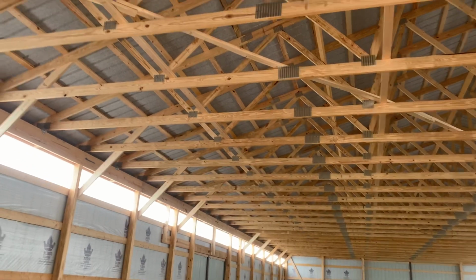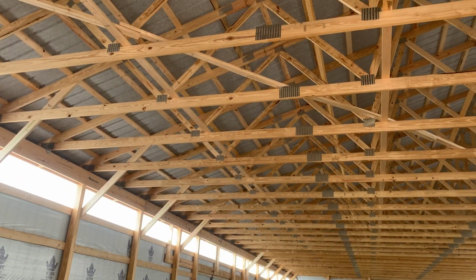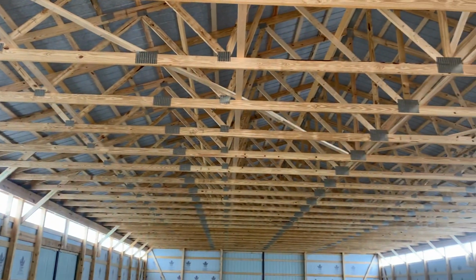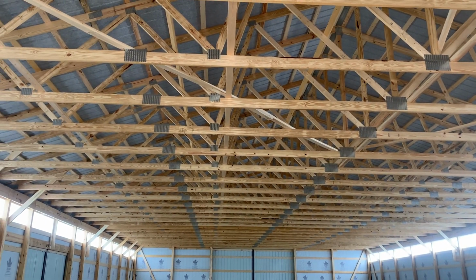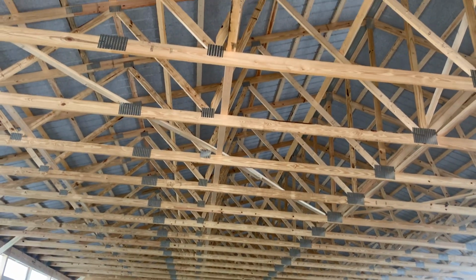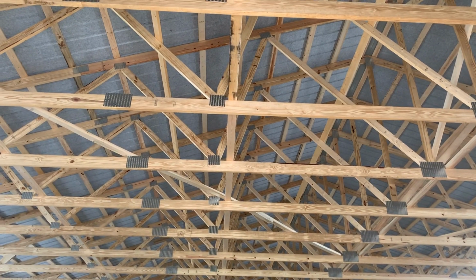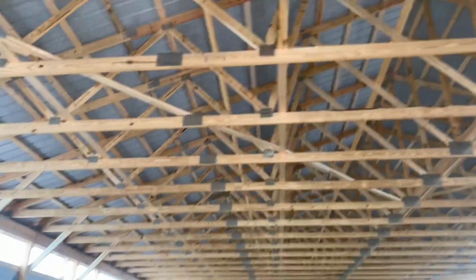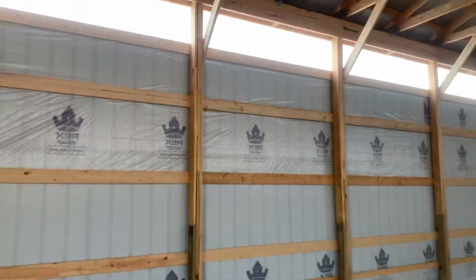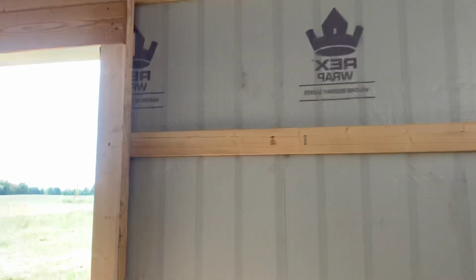Okay, trusses, obviously when you're going a little bit bigger here on a 60-foot truss, you gotta have your load bearing here on the bottom chord of this. It was spec'd out at 2100 MSR, machine stress rated. Then also the top chord was spec'd out 2x6 machine stress rated. Now again, all of our lumber that we use, we don't use number 2, we use 1650 lumber. And let me share with you what I mean by that.